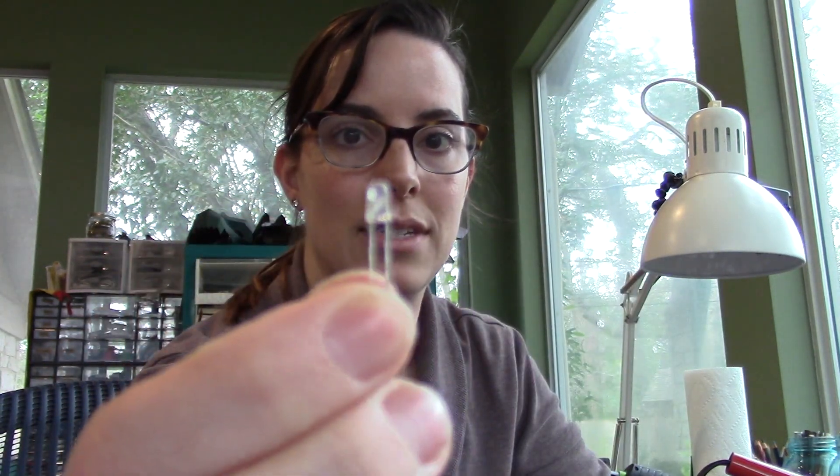So today I'm doing the smaller version of it. It'll be about this small when it's done. I'm putting in two tiny LEDs. They're yellow, but they're not diffused, so I'm going to be sanding them to diffuse them a little bit and make the light come out a little bit nicer. I'm soldering them together with two resistors, 220 ohm for those.